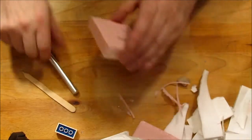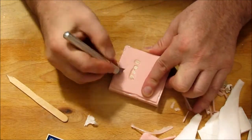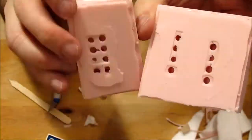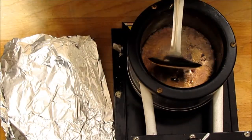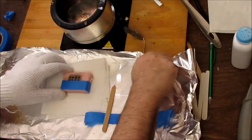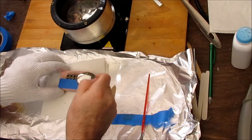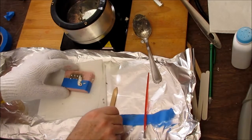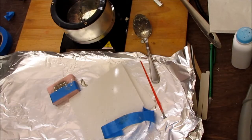Alright, I've got one more to do — let's do this one the quick way. Let's heat up a little metal. This is a Lyman Big Dipper casting furnace — I'll put the Amazon link if I remember. This alloy melts at about 450 degrees. Let's grab a little metal, skim off the top, pour that in there, get rid of the extra metal on top, and we'll let that cool off.